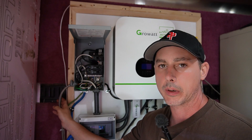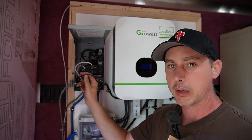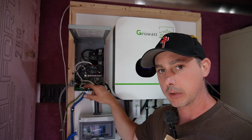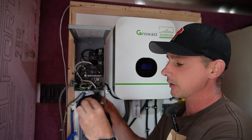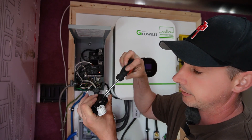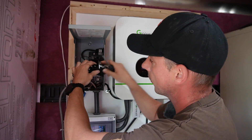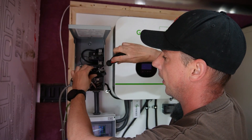I already have some cable run outside — this is some armor flex wire. It runs into my panel and I have my load wire and my neutral wire, and then I have my ground wire already on my neutral bar. This bar is bonded with the grounding bar, so I can put my ground wire on my neutral bar. For this, I'm going to open up the screw on the neutral side and connect my two wires. My neutral side is on the silver screw and then my hot wire.